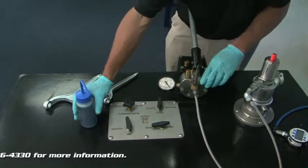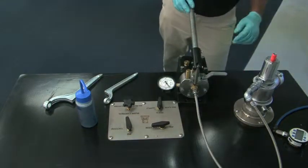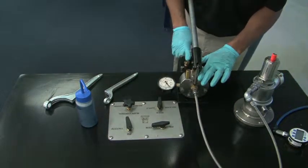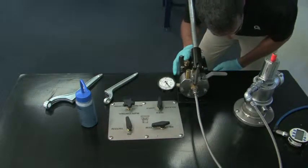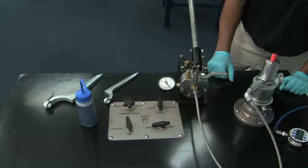Make sure your indicator has come up — that indicates the pressure is still holding. Make sure you still have pressure at 1,000 psi. If that is all clear, that means the test passed. At this point, your GVR hydraulic valve has passed the test.